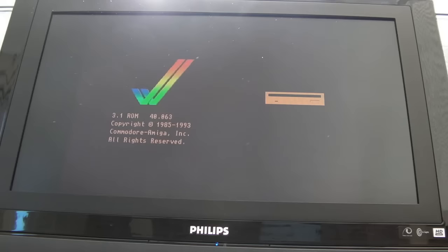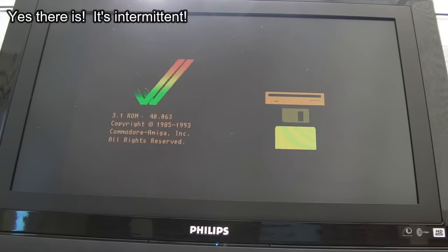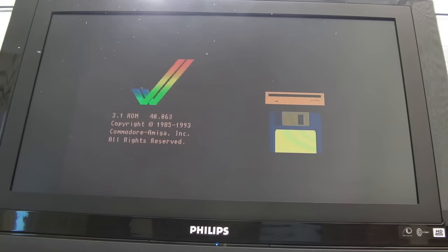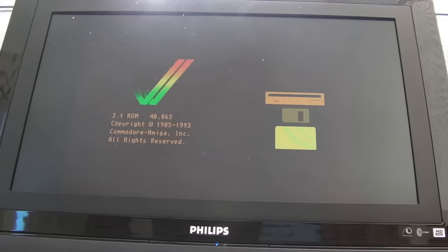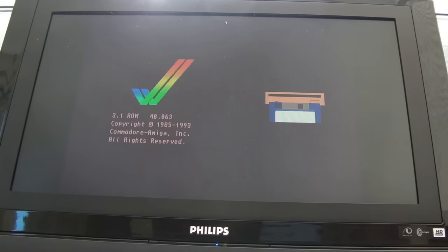The Amiga is booted now. I've switched that jumper to the right side — which is the left side — and then we get the display. This suggests to me there's nothing wrong with this card other than it needs to go into an A2000 powered by a power supply. It needs that 60Hz tick from the PSU — a 60Hz pulse — for this to work. When in the other position, the PLL is not locking. That trim cap probably needs a tiny tweak. The next thing I'm going to do is get the A2091 in there, boot with Workbench, try a higher resolution, and test some games.